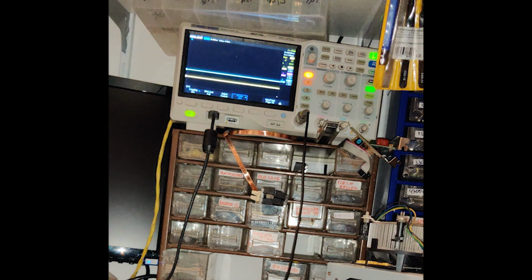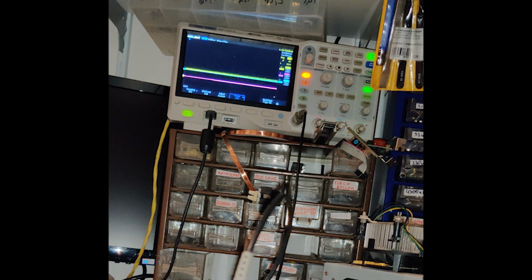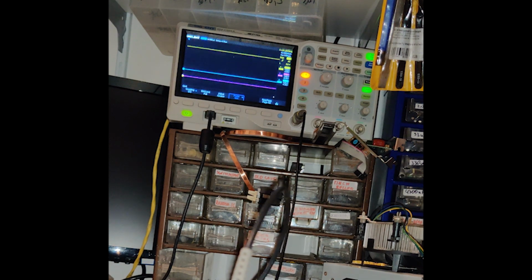Like, obviously the bus is gonna be 64 bits on this weirdo CPU. And it's got some lines, mask A0, mask A1, mask A2, which are then A0, A1, A2 of this 8-bit ROM chip. So to read 64-bit words, it would have to read 8 separate bytes of this ROM. So we should see some toggling on A0 for sure, but we don't. So A1 looks completely normal, and A0 is really messed up.